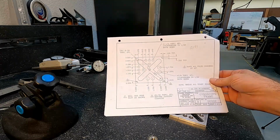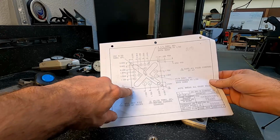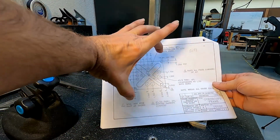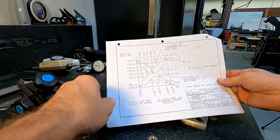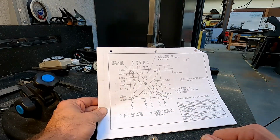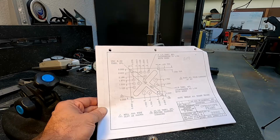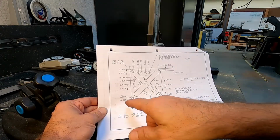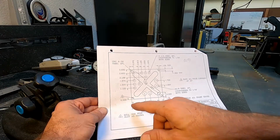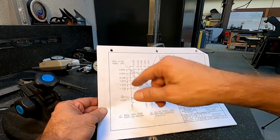Okay, so the next section of our gyroscope frame, there's a couple more holes that we need to put in. We're looking at putting those ones right here in the corner where eventually our wire ring is going to go around. We could have done that on the milling machine when we did these additional holes here. But in the idea of getting through more people at a time in a normal lab, we typically go ahead and run these on the drill press. This also gives you a little more exposure to some new tooling. And then we'll use a sander to actually take those corners down at 45 degrees.